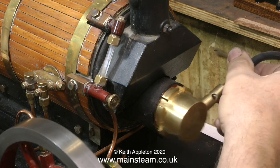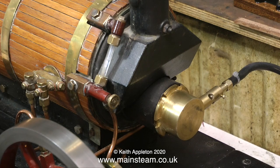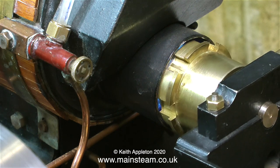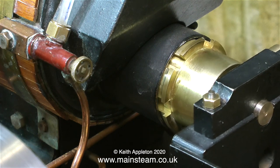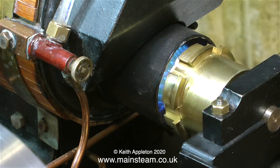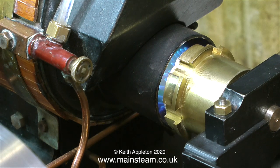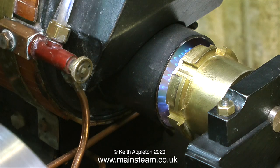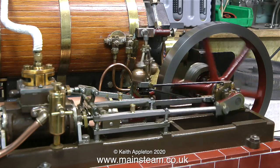The main problem with ceramic burners is making sure you get enough secondary air for complete combustion of the gases. You have to be careful — if there's a bad smell coming from the chimney, your gas burner is emitting carbon monoxide, and if this is in the house or in a small garden shed you could have a severe health problem. Always make sure that you have a working carbon monoxide alarm.